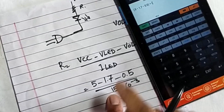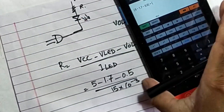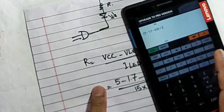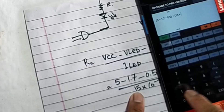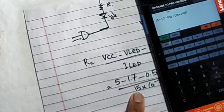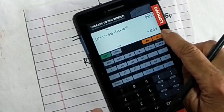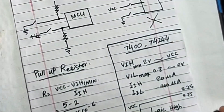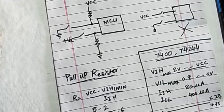These parameters — LED color, size (3 mm or 5 mm), and forward voltage — are available in the LED datasheet. With 15 mA the result is 186 Ω. If we are using 12 volts, the LED resistor will be 653 Ω. I hope this video is informative. If so, please give a thumbs up, subscribe to the channel, and leave any questions in the comment box. Thanks for watching, assalamu alaikum wa rahmatullahi wa barakatuh.